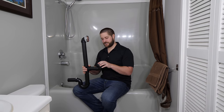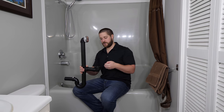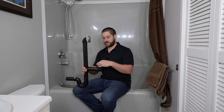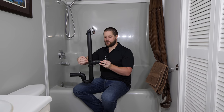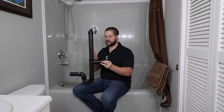For the tub drain, this is a threaded connection. This gets threaded into the drain. There's a washer underneath and the washer gets installed underneath the tub. Then the underside of this flange is either going to be sealed with bathroom silicone or plumber's putty. That gets threaded on top. Your tub is going to be sandwiched in between, and this gets tightened down. The pop-out is removed to actually tighten it in. This all flows down into a TY which then flows it down into a P-trap, and this P-trap is designed to hold water so that the sewer gases don't come back up and into your bathroom.